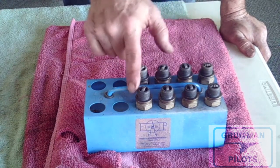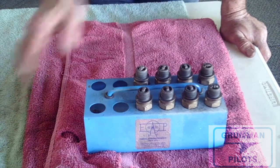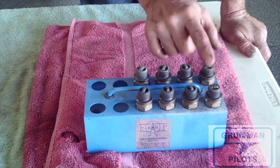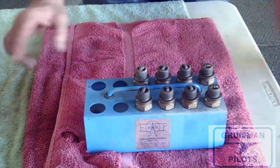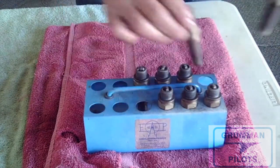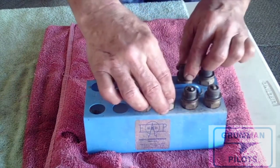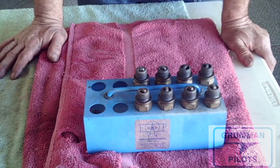We have all the top plugs here — cylinders one, two, three, and four — and the bottom plugs. They've all been cleaned and gapped. The only one that'll get rejected we'll leave in for demonstration. Now let's do the rotation: cylinder one top and four bottom are swapped, diagonals are swapped, the two inside are swapped — and there we have swapped all the plugs. Let's put them back in the original position.